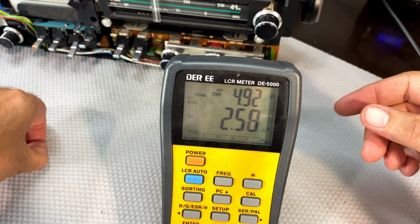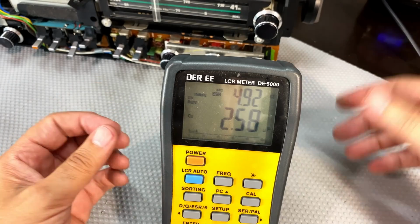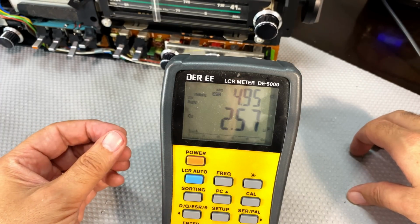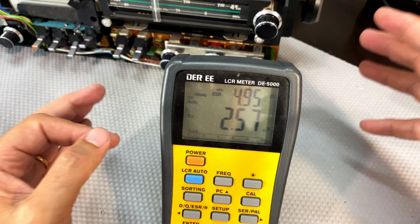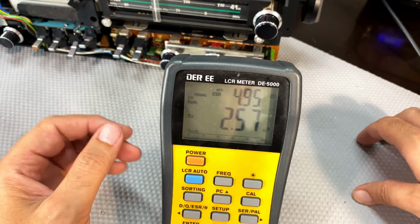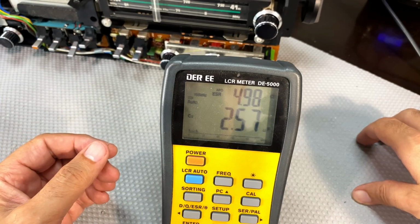Oh man, this is where getting help from viewers and friends makes all the difference. Somebody had this problem. He's Stefan, he's got a channel as well. He had this problem and he warned me. He said, if you don't get FM, check out this capacitor. It does this, this, this. He told me exactly what it does. And I had that on mine. I took that out and it came back. It's exactly what happened. I probably would have swapped it out anyway, but it's so much easier when you can get somebody else's experience and put it into effect and see the result.